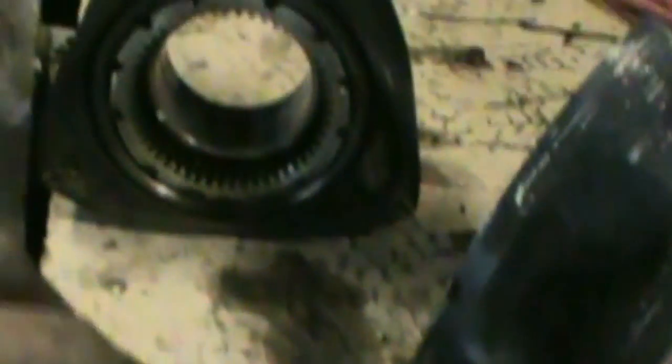With the rotors you just want to check out all the grooves, make sure they're still all squared up and there's no V-ing or anything like that. These ones I checked them all over — they're pretty good. The bearings inside you reuse them unless there's a lot of copper showing; the limit is like 20% copper. But these ones are all pretty much new in these rotors. So it's pretty much ready to go — I just have to take the seals out and start cleaning these.